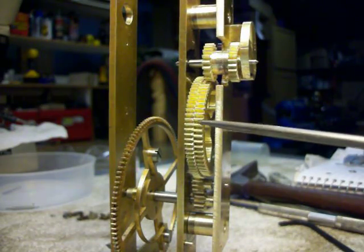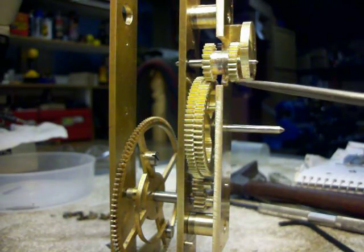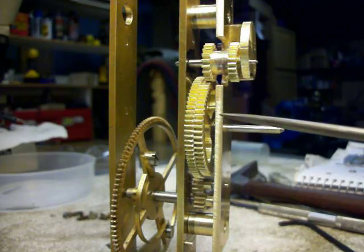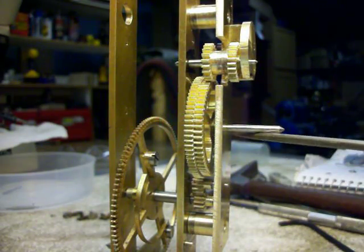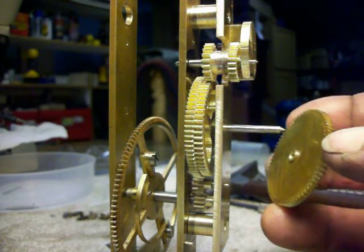From here the 61-tooth goes to a 20-tooth pinion, over here to a 24, and right here will be a 73-tooth wheel. This 73-tooth wheel will also be the star plate, which is what this gear ratio is indicating.